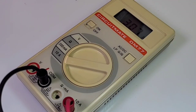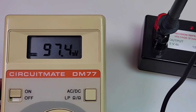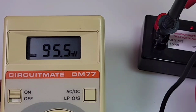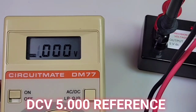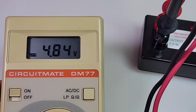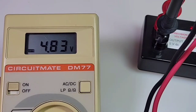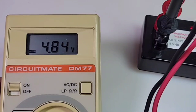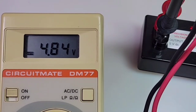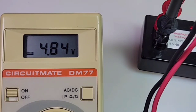Let's try some DC accuracy. Five volts is what we want. Put the test lead in — it makes a little beeping sound, a little chirp, just to let you know you are in measurement mode. Wow, look at that: 4.84 volts. That's a little short. So 40 years later, it looks like we do need some adjusting — 4.84 volts is definitely not five.